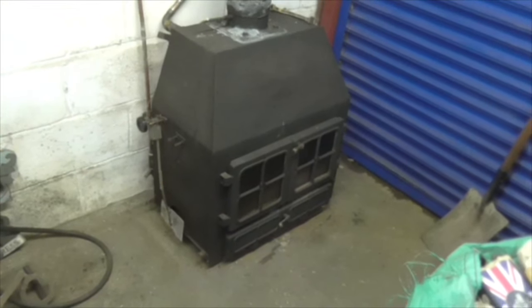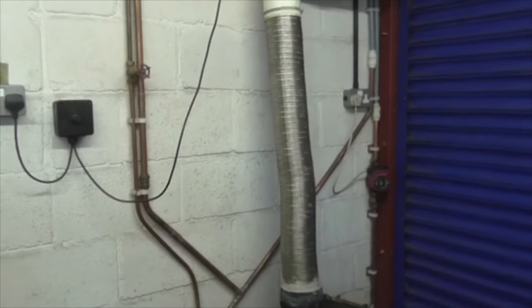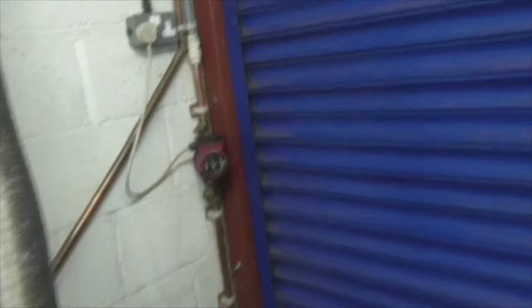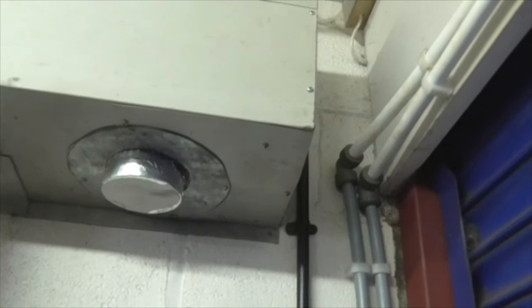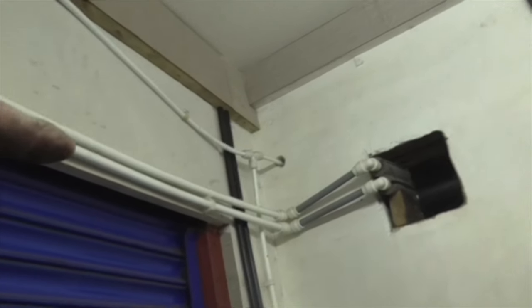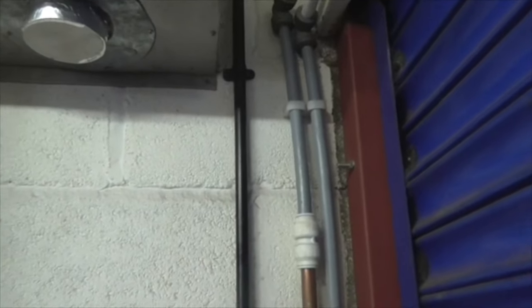It didn't circulate. So it wasn't the pump. So tomorrow, what I'm thinking of doing is taking those two elbows off, because they're screw-on ones and they're easy to dismount, easier than these to dismount. Dismount it there. Blow right through the heat exchanger and back to here. And then we've confirmed that we've got no blockages in there.